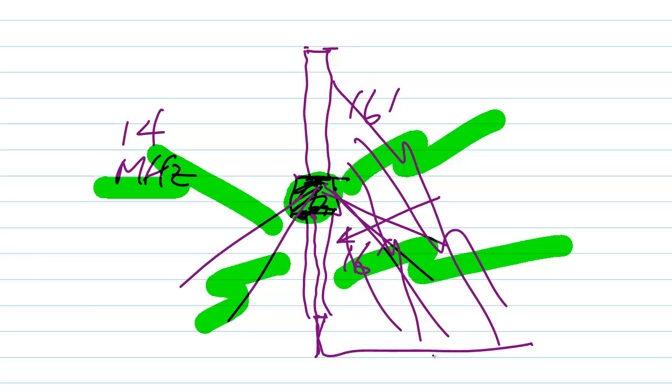So that is the evolution of the coaxial antenna as a modification of a vertical dipole. So you can think of a coaxial antenna as a metamorphosis of a ground plane or a metamorphosis of a vertical dipole. Those two designs converge in the venerable coaxial antenna, which I have used, by the way, on 20 meters with great success.